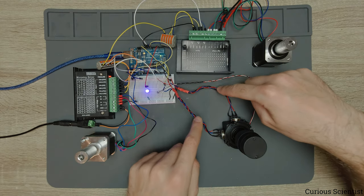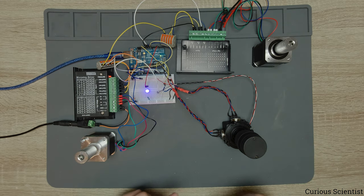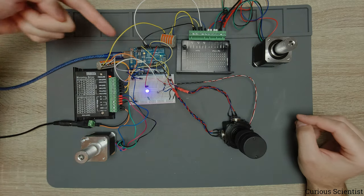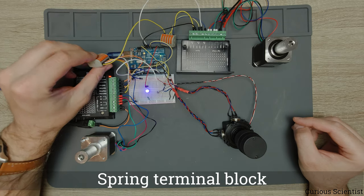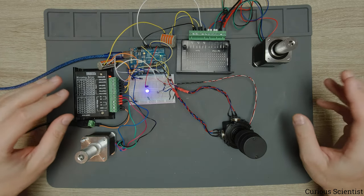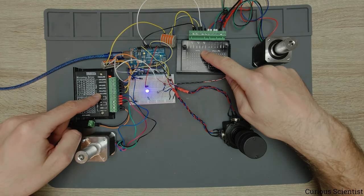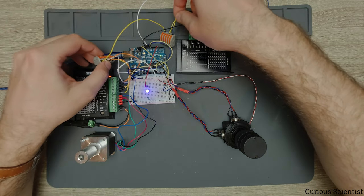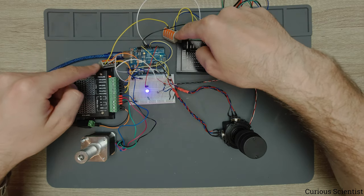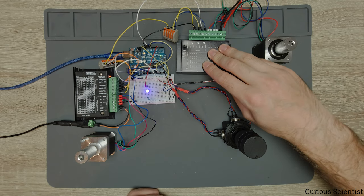I don't really want to move things because these wires are quite rigid and they would just pop out from the sockets, and I don't want any short circuits. We're driving everything with an Arduino. These special clip terminals connect certain pins on the two stepper motor controllers, and all those wires are connected to the plus 5 volt of the Arduino.